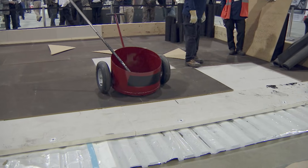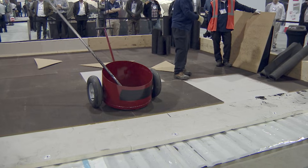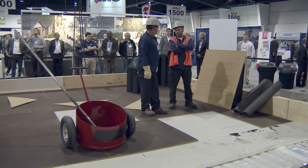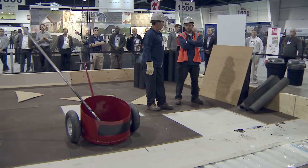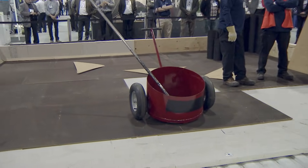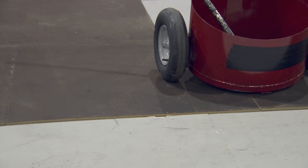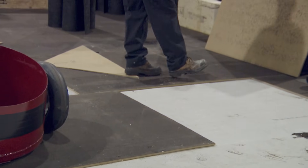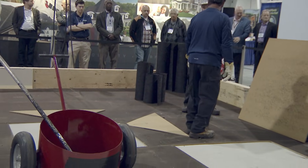The key to this system is that whatever we lay today, you have to cover a membrane to protect it from the elements. It may not rain tonight, but there could be dew and all your boards would get wet — that's the worst thing you can do is trap moisture in your system. Safety is the most important factor. We would all be tied off with safety belts or guard railings.